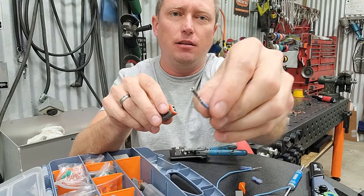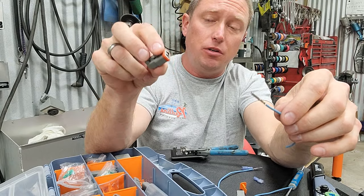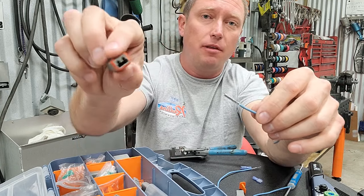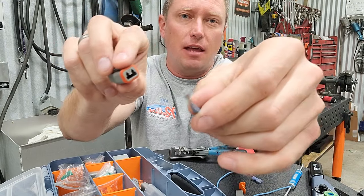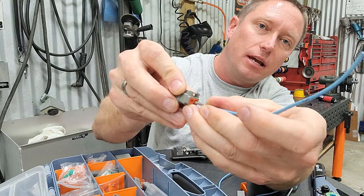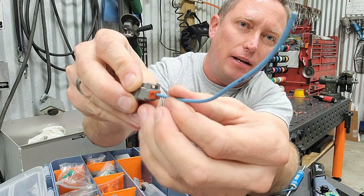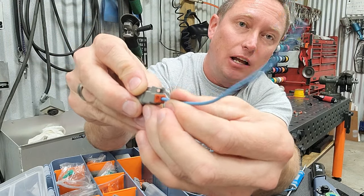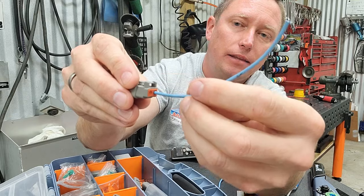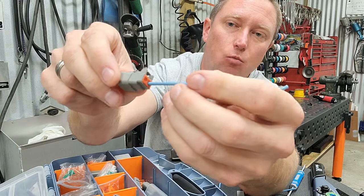Once I've got my little electrical terminal on the end of my wire and I'm ready to insert it into the housing, first make sure you're using the correct housing — you don't want to use the male terminal with the female housing and so forth. That is your female housing and that is your female terminal. All you're going to do is slide that right up into the little silicone block right into the back of it, and you'll hear it kind of click in right there. You've got this little silicone block right there that seals off the wires so that everything is nice and watertight.